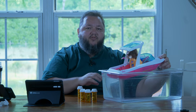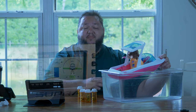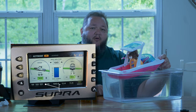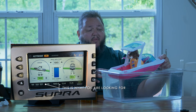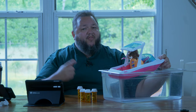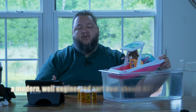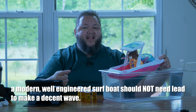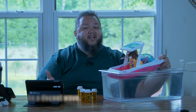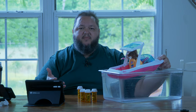The inverse is even more important. Let's say you're at 100% and your bow is up to 12 degrees — that's rare, but let's say that was the case. You don't want to be putting that wake plate all the way down to force the bow down. You're creating turbulence. It doesn't make the wave as clean as if your wake plate is in a neutral position and you adjust the weight to get it there. That's where the lead comes in. If you're running your perfect pitch and roll and your front ballast is only 50%, you have to add more weight to the rear so that when you fill up the front you get to nine degrees. If you have 4,000 pounds of water ballast but you're always running around with 3,600 pounds because you don't have the front filled up, you're not getting the most out of your system. That's where the lead comes in.